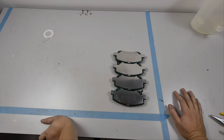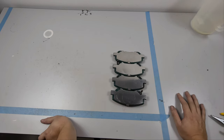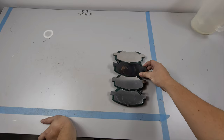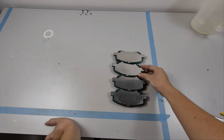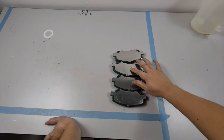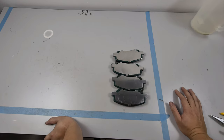And you're probably wondering, hey, you did a metal polishing on the shims, would it be any thinner? Well, not really. Actually, it's negligible. It's less than 0.01 mm. So yeah, well, that is if you practice moderation, don't go all the way extreme till it's mirror polish on all fronts. If you can see, I don't know if the camera can capture it, there are some dents over here that I didn't polish out. Alright, because if I were to do that, I would have to actually sand the metal down even further, which is not something I want to do.